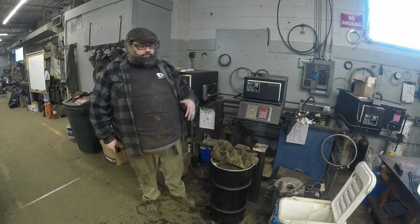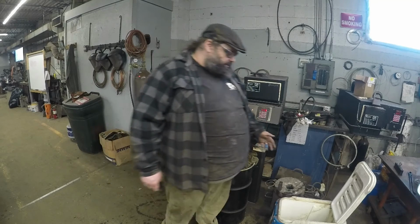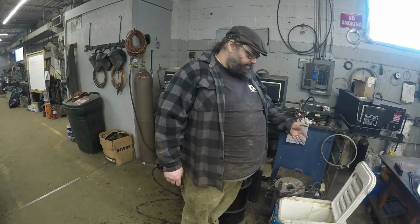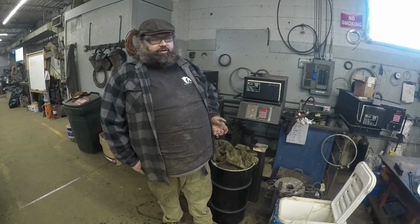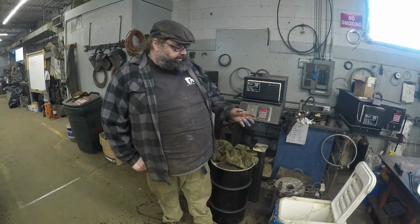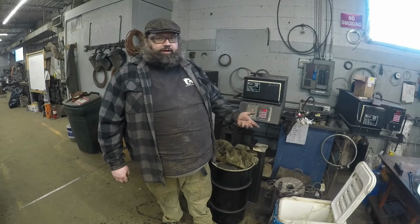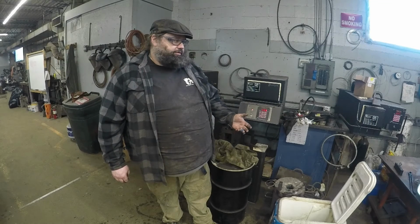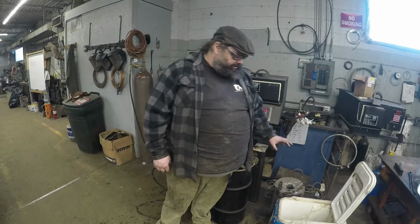I let them cool to room temperature, and then they went into the dry ice slurry, and they've been in there for a little bit over an hour. That should be negative 100 degrees or thereabouts. The dry ice is like negative 96, I think. It's an alcohol bath. In this case, I ran out. I couldn't find any isopropyl, so I ended up using Graves, which freezes at 170 degrees below zero. It actually worked a little better than the isopropyl did. It's not as slushy, so that might be what I do in the future.